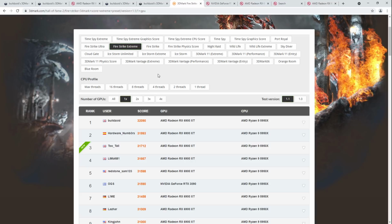I might be a bit biased, because even Vega has that minus 75 Celsius limit, where if you go below minus 75, it doesn't outright crash, or at least it didn't used to. Maybe on the latest drivers it does crash. But when I tried to run Vega in the past on liquid nitrogen, if you went below minus 75 degrees, it would basically stop performing. The card would slow down really drastically. So that wasn't cold bug, that was cold slow. But 6900 XTs just turn off completely. So it makes it a bit simpler to work with, I guess. You don't even have to try going below minus 75 because it just doesn't work at all if you do that at idle.